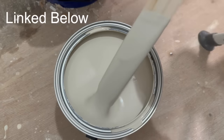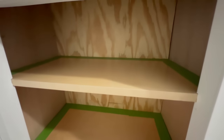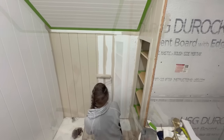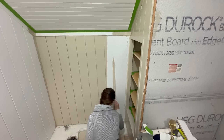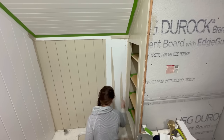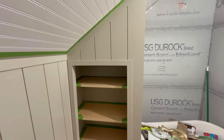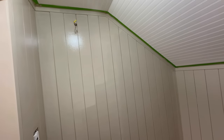It's finally time to paint. I'll link the color in the description below — I wanted something that wasn't too dark but still had a warm tone, and I think this one fits the bill. Inside the cubby shelf system I wanted to keep the shelves the natural wood color but paint out the box — the sides and back — which will give it a nice built-in seamless look. Painting shiplap takes a little more time than a regular wall. You have to come in with a paintbrush to get into the cracks and crevices, then come back with a roller to smooth it out. After the first coat it's still a little shiny and wet, but it'll tone down with a satin finish. We'll need at least a second or third coat to get into all those cracks and crevices.